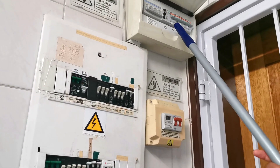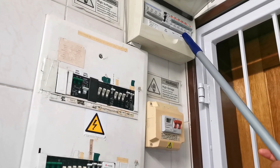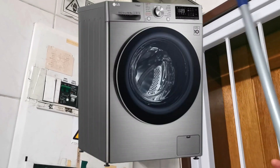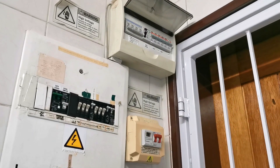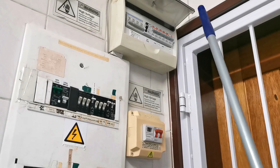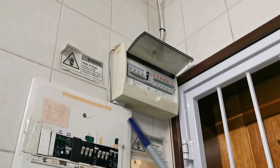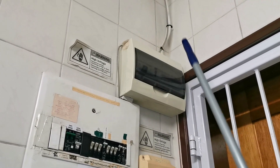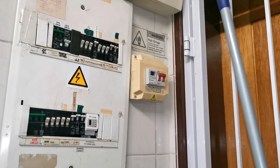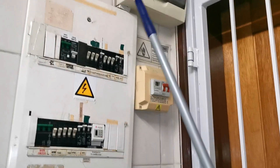These are all DIN rail mounted breakers. I've got three plug breakers here and three light breakers, so it's all small loads - my washing machine, my computer, my internet, and all of that is on plugs. The entire house lights are on the backup as well. That is how you separate the backup from your main utility.